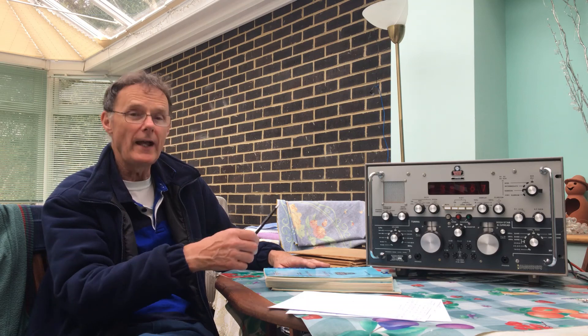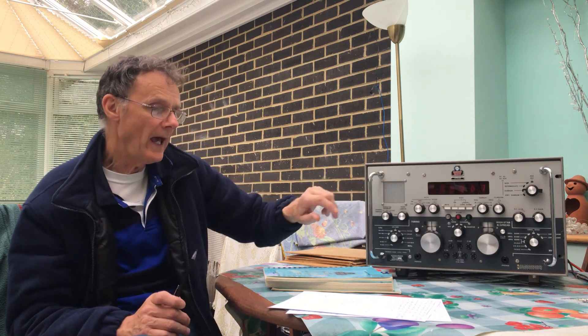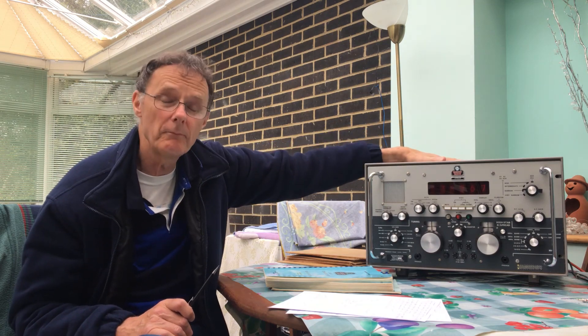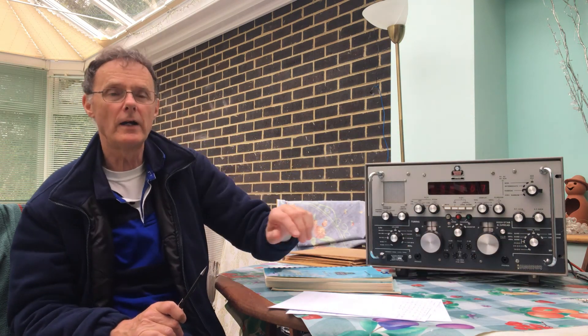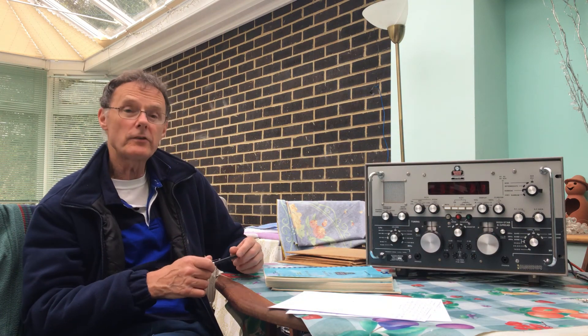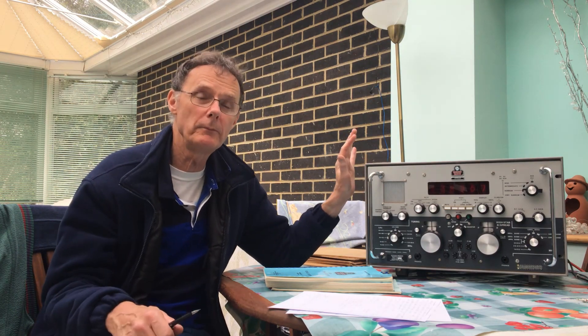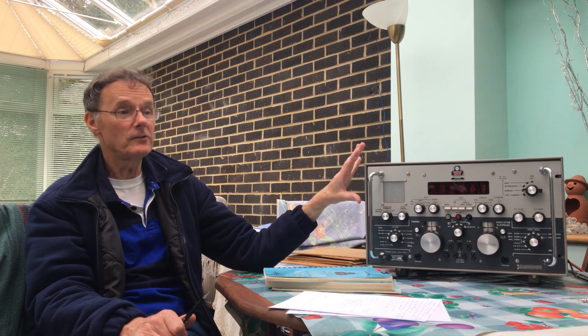The set itself is beautifully made inside. The counter to drive this lot has eight separate boards, then there's the left hand side which includes the RF and major AF board and power supply in the middle, and then the right hand side for high stability. It's a lovely thing to work on. We'll have a look inside in a minute and point out a few more bits and pieces. This is serial number 1806, an Apollo obtained a long time ago via Marconi Marine's East Ham Depot. This is G4EOA — thanks for watching, see you next time.